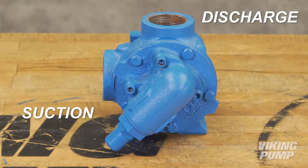You're going to want to confirm that the relief valve is properly oriented and properly set. Internal relief valves on Viking pumps are typically located on the head and should be pointed with the adjusting screw cap towards the suction piping. System valves are usually located in the discharge piping very near the pump.